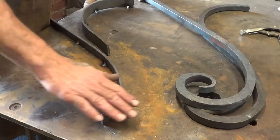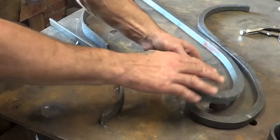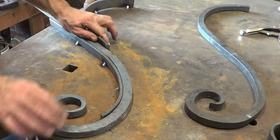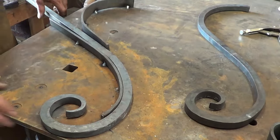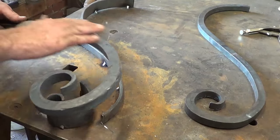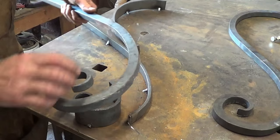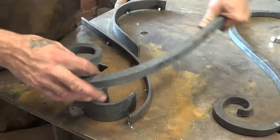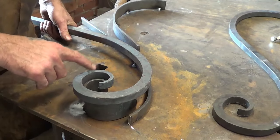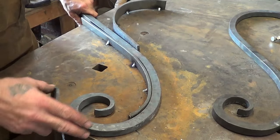Returning back to the land of the living. I reconfigured my jig — I hadn't expected to remove this particular part of it, but I had to because of the shrinkage inside here; not all the curves fit. We're going to clamp this down on the jig so that we're lined up right with the table, and this piece here will be heated and we'll bring it right up and around and straight out. Also, if you rewind to one of my previous bends, I had the piece straight, but before going to the jig I put just a bit of a curve in there so I'd have something to hook to — it didn't have to be exact, just a little bit close, about an inch and a half.